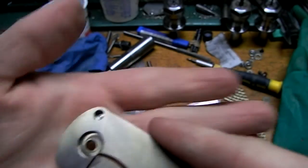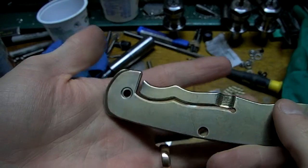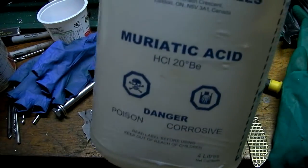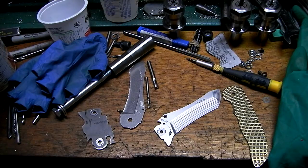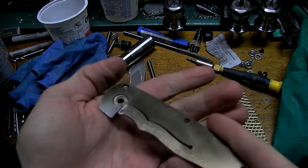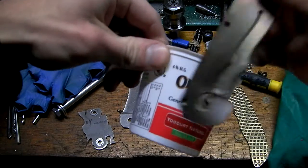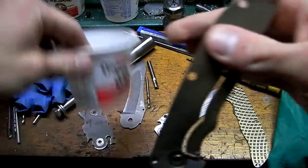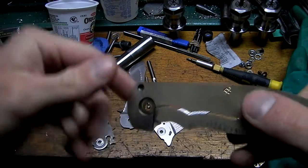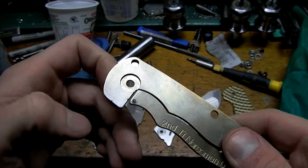So to remove this piece of steel — or stainless steel ball, whatever it is — from a titanium handle, we are going to use muriatic acid. Ideally I would use ferric chloride, which you can get at like a Radio Shack for etching circuit boards. But I have muriatic acid and I know that it eats steel because I've used it for that before. So I'm going to fill a little yogurt cup just enough to cover that ball. Don't want to waste too much. Baking soda will neutralize it, so I'll use just a little bit and then fill it with baking soda to neutralize it all. Hopefully that will dissolve the ball and I can press another one in there.